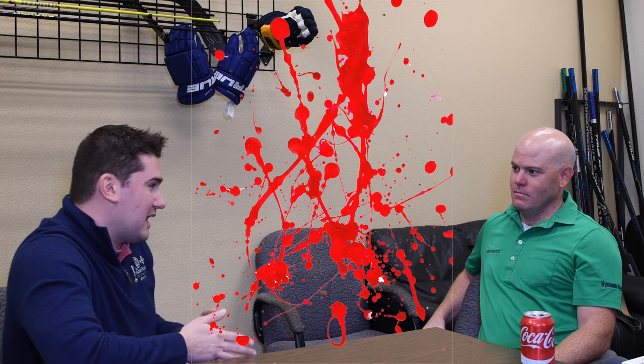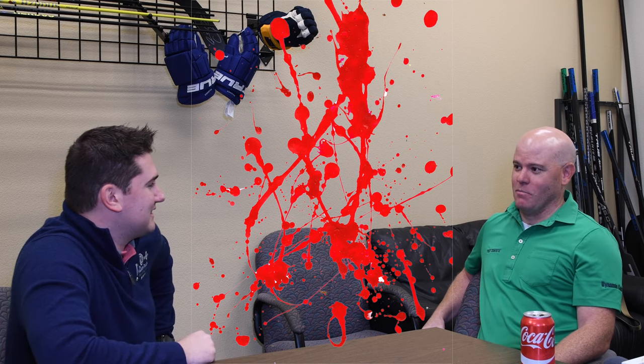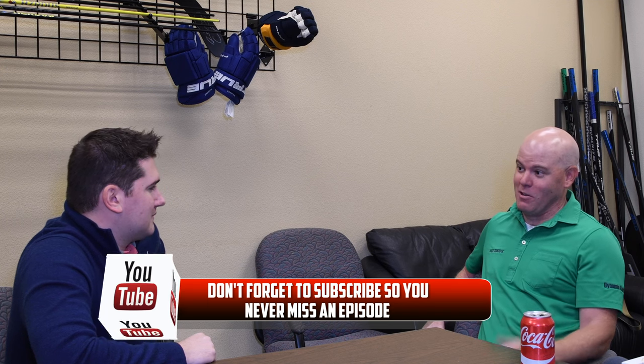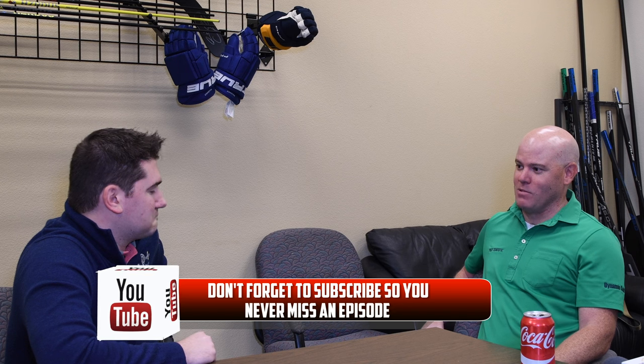One of my favorite rooms in your lab is the paint room, because I always thought it was a big mystical process of how paint gets on the shaft. Really, as we saw on the tour, it's quite low tech. It's a very simple squeegee process, and it's something people have tried to improve upon — people have built robots to try to squeegee the shaft. Squeegee machines have been chased throughout the industry; there's been some success, but no revolutionary solution. You can spray shafts — the T1100 paint is sprayed on — but the efficiency ratio of how much paint you get on the shaft versus how much sprays into the atmosphere and onto the back of the paint booth is way worse than squeegeeing. So while it certainly looks low tech, it is the most efficient way possible to paint a golf shaft.